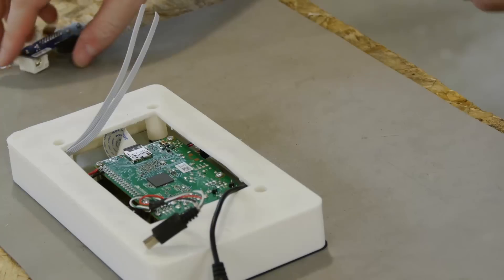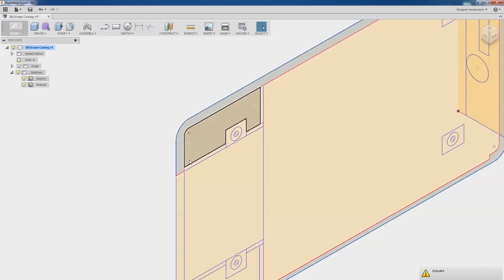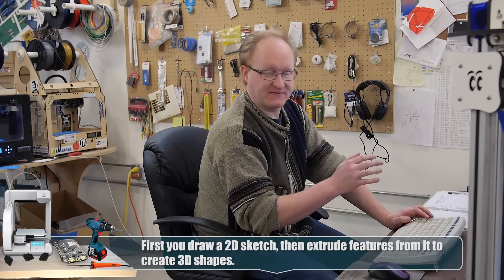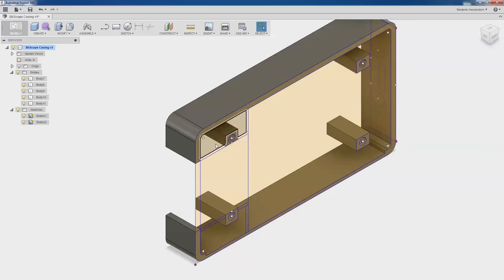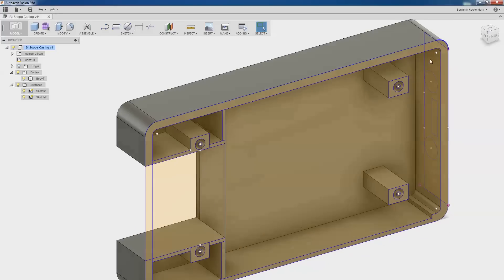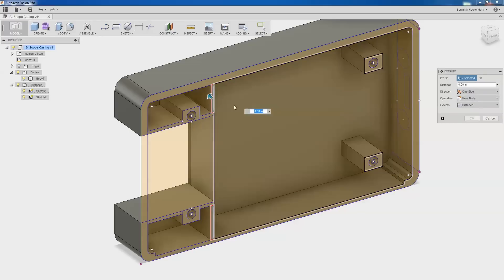Whatever stand this is on will attach to the plastic. We can obviously shrink this down from our first test — maybe do it in a couple of layers. I'm designing this from the front, so this is where the glass sits. I want one inch of space inside, so I'm going to go back 1.125 inches — the 0.125 will be the rear wall. That creates a solid shape. This gap here is going to be where the USB access is. The inner part will be empty — that's where everything fits. I added some walls here just to give it some enclosure and strength, although I'm going to reduce those so we have space to run wires — about halfway. Down here on the end we have our jacks; I'm going to make them a little bit wider for more tolerance.